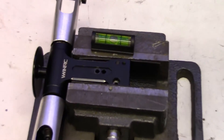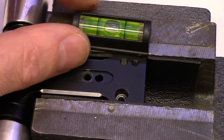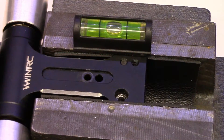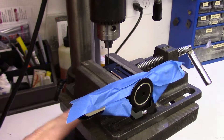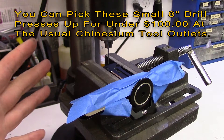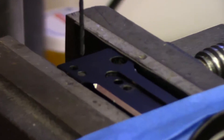I've got the head mounted in the drill press vise, and I've just put a little piece of leather in there to protect the head when I tighten the jaws. I want to make sure the head is level in the vise so the drill isn't going in at an angle — it's going more or less straight down through the bolt. Now these are hardened steel bolts, so you're going to need a nice sharp high-speed steel drill bit. This is just a little benchtop 8-inch drill press — it's why I say on my RC helicopter tool page that a drill press can be a useful tool in our hobby, and this is exactly one of the reasons why. You could probably do this freehand, but I wouldn't want to try it.